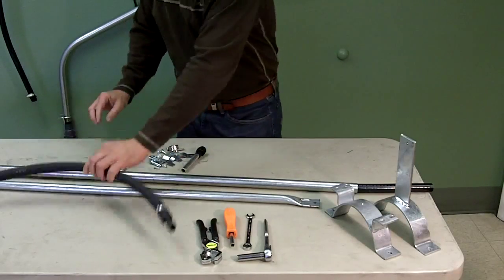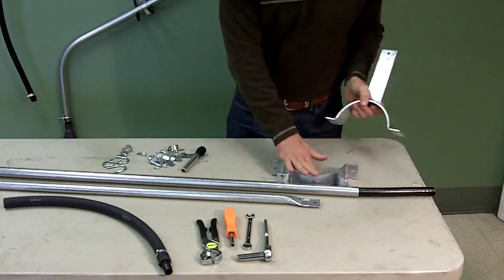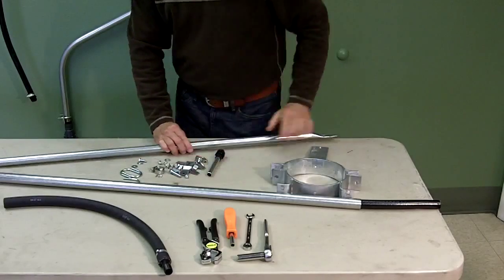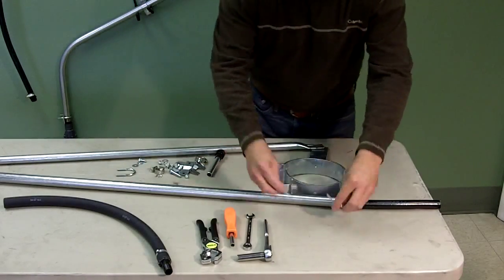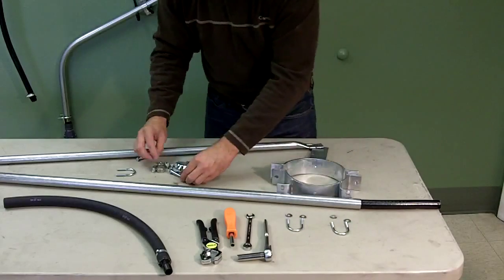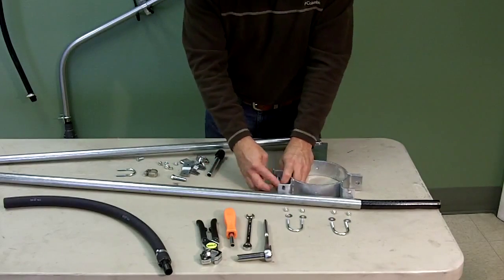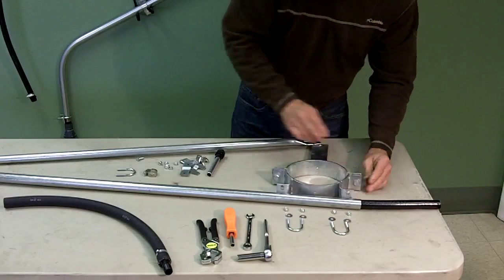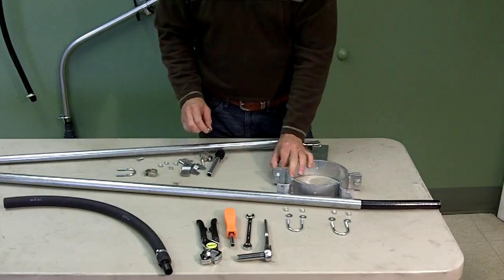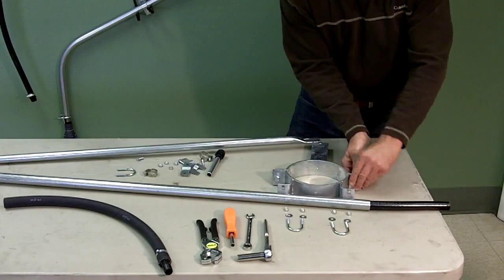Now I like to line up all the different parts: the bottom bracket, top bracket, boom, the brace, and the U-bolts that connect the boom to the bracket along with the washers, and the nuts. Then take and put the 3/8-inch bolts into the bracket and put the nuts on. These are nylon lock nuts. You're not going to tighten it all the way up, but you want to make sure they're secure so they don't slip off — especially when we put this in the truck to haul it out to the field. You still want to be able to take it apart with just your hands.